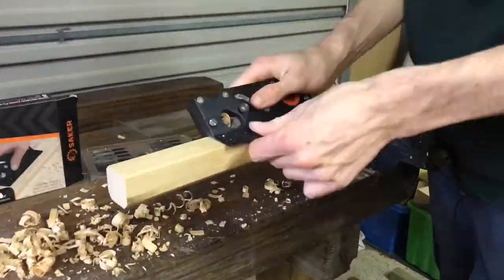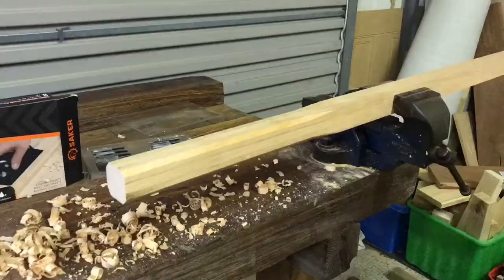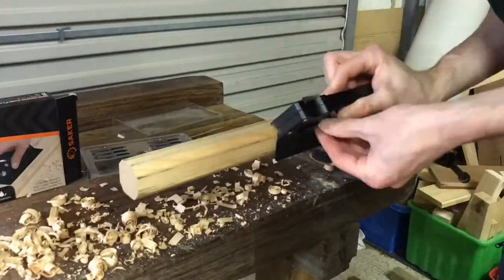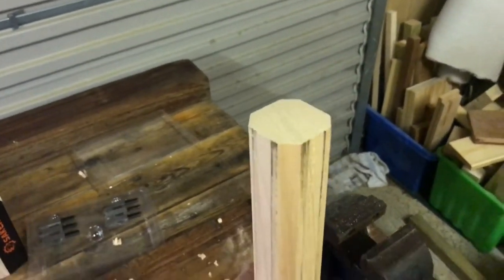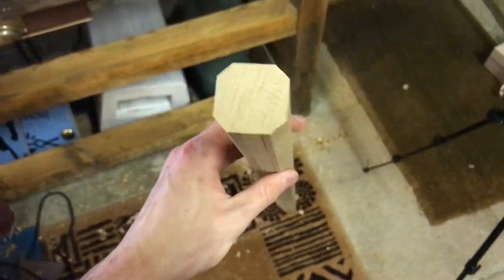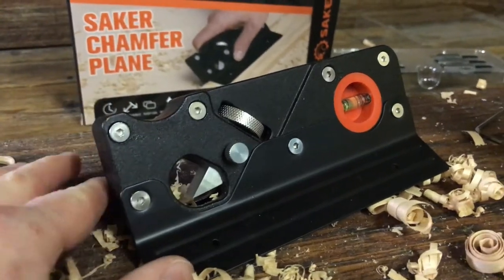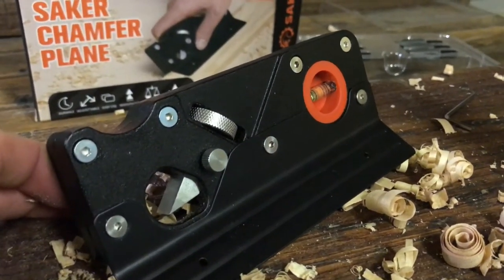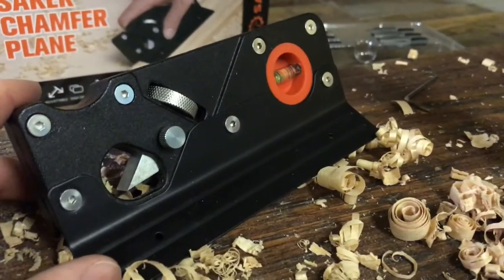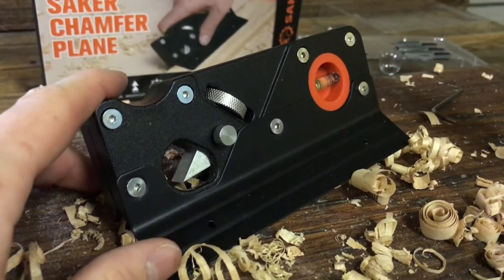I then continued the process, adding a chamfer onto each of the four corners of the square stock. This produced octagonal spindles which I could then cut up in order to make some nice decorative feet for the box. I think this really added another level to the box and I'm really happy it looked good. Whilst the chamfer plane will take longer than an ordinary plane, it produced a very nice octagonal spindle. Like any plane you can only take a certain amount of material off each time — a couple of times I did take a little too much, which resulted in some tear out. But if you take the right amount off you can get an incredibly nice finish, and as you can see we've got some really nice shavings. All in all a decent tool — I'll leave a link below. Thank you very much to Seika for sending it out.